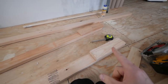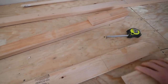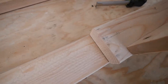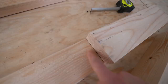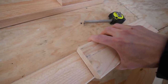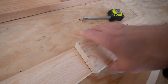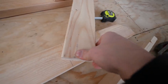This bed is going to be super simple but I want the legs to fold — I'm not going to just screw them in tight. Right now I'm just positioning my legs on the side rail. I marked my pivot to be center, three-quarters of an inch back from the edge of this board. The leg is actually going to sit here, so I just picked a good spot. I'm drilling through here into that wood so I can get it lined up exactly where I want it, then rotate it on the pivot and figure out the next step.